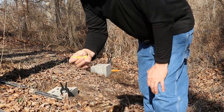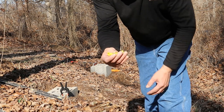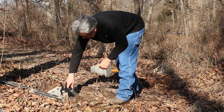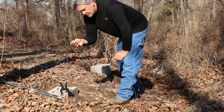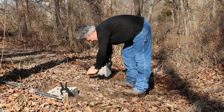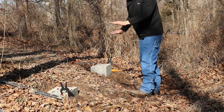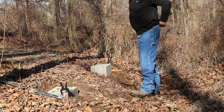There are numerous ways of leveling things up. If you have a laser level, that's perfect, or a transit. Or if you don't have that, you can use a string and one of these line levels — this just simply goes around your string. And then when you get it level, what I've done here is I used my clamps and clamped the string to the block. This also helps me get it square with itself, and then I'm going to put this line level on the string. We're pretty close there — it's in the bubble. By the time we've put our log structure down on here, this is going to move around a little bit, so get it as close as you can and then check it after you actually get to moving along with the logs.